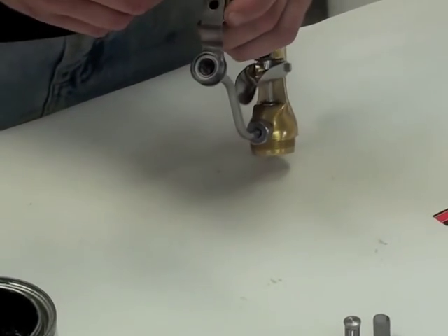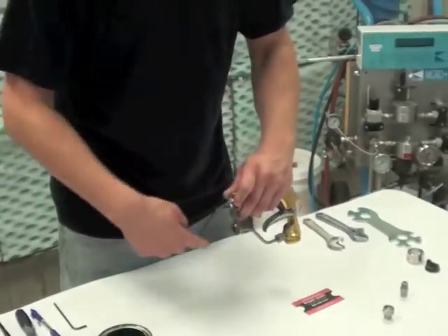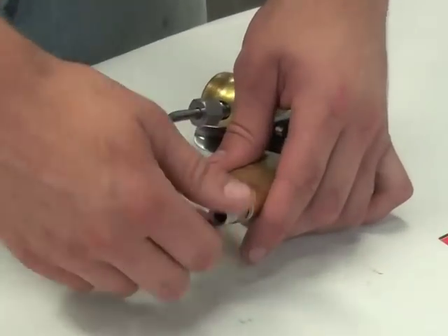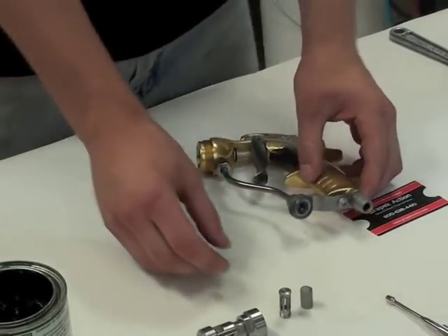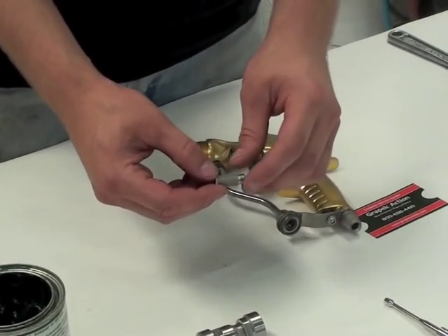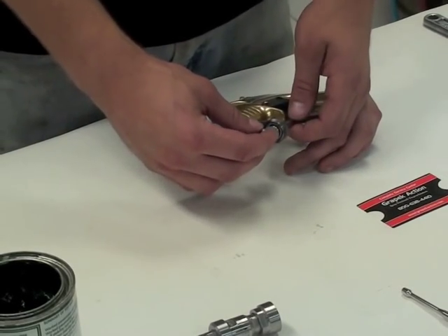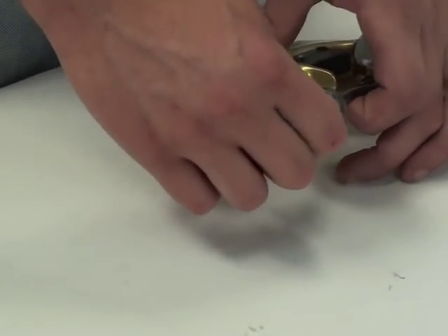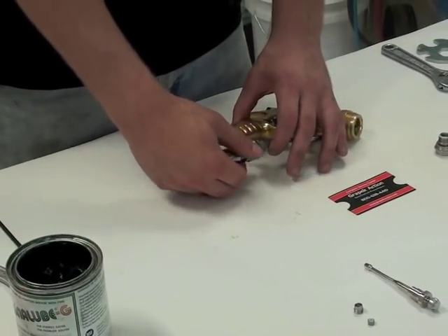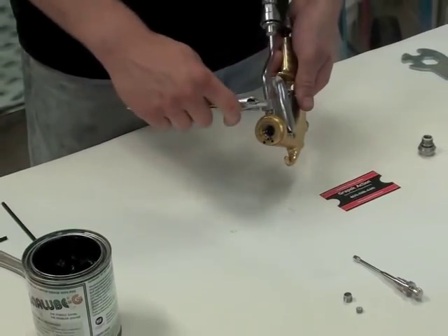The next step is to begin the screw here. Once you have that tightened down, you can insert your air inlet nipple. Once that's in, take your filter screen support and put a new filter on it. The screens come in different sizes depending on what material you're spraying. Now that your screen is on, it installs in the bottom of the fluid tube — just tighten it down by hand. Once that's in, take your fluid swivel and put it on, then tighten it down with a wrench.